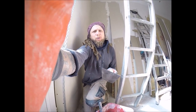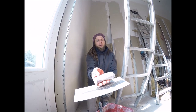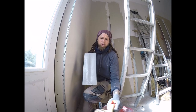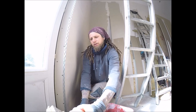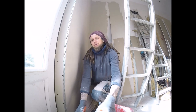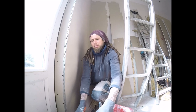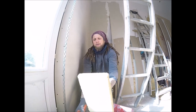Right, my finishing trowel is a Marshalltown extra light gold perma shape. It's one of the go-to trowels most people use. For sponge floating, I use a tile cleaning kit because they're really handy. I put a sponge in and keep rolling it until there's barely any water on it. You don't want it soft and wet. So squeeze out all the excess.